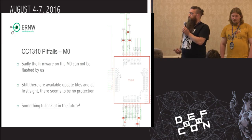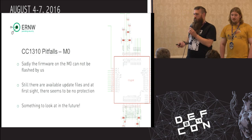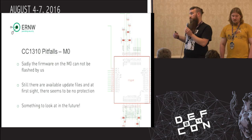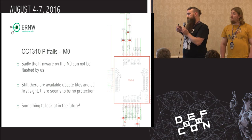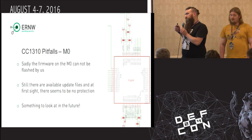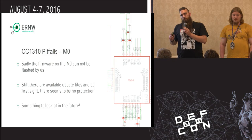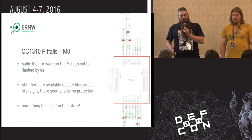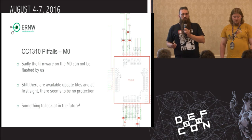Also the data rates are only supported up to 100 kilobit per second, not 2 megabit as TI announced earlier. Still the current state. Also the TI RTOS, which we wanted to use because every driver lib is already included, got some strange BSD-like license which forbade releasing binary code. So we switched over to Contiki, which is an IoT RTOS. As I said, status today is unchanged — we are waiting for TI to finally release the whole thing they announced.